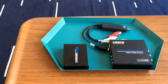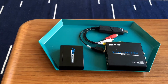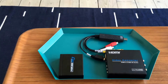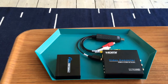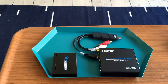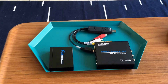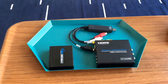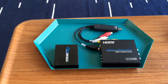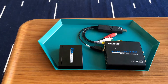Just over here we've got an HDMI splitter. What we're going to do is take a signal from — in this example, from my Xbox — via HDMI, and split it into two. One signal goes straight back into my television because I don't want to alter the image in any way, I don't want the process to create any lag. And we're going to send the second split signal through into the video converter and on into the Raspberry Pi. I'll show you how these all plug together in a moment.